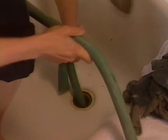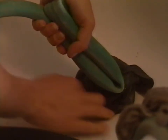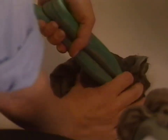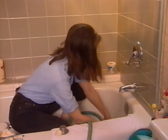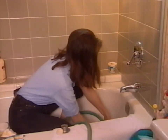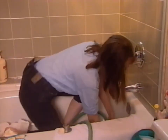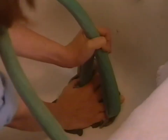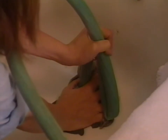The important part: you have to pack it — otherwise you're going to get a face full. Force as much rag as possible down into the hole around and about the hose. Notice I've got this double kink working for me here. That's a really good move, because when that water comes on it's going to pack some pressure. Now I cue my helper: turn on the water, please.